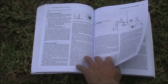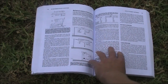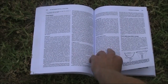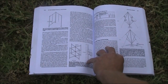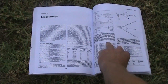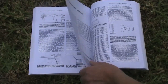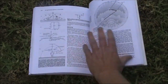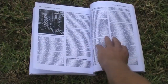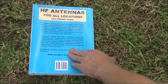The antenna and its environment — useful to read if you go QRP portable. He talks about ground sloping towards your desired direction, which can improve your results. Single-element antennas, quite cheap and simple to build. Horizontal beams. Moxon also talks a lot about vertical beams — less used than horizontal beams, but you can make them out of wire and switch around the directions, so they can be quite economical, especially with squid poles and fishing poles as a centre support. Invisible antennas — so you can conceal an antenna, maybe in your roof, and still get on air. Finally, mobile and portable antennas, and how you know your antenna is working and test equipment. So that's HF Antennas for All Locations by Les Moxon G6XN — I highly recommend this book for the antenna experimenter.